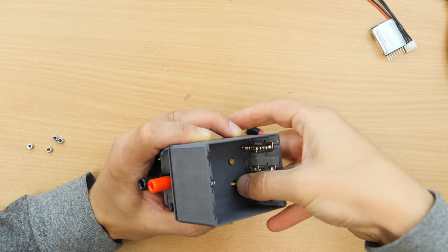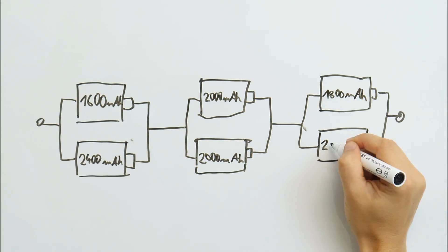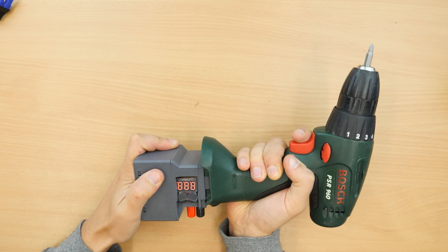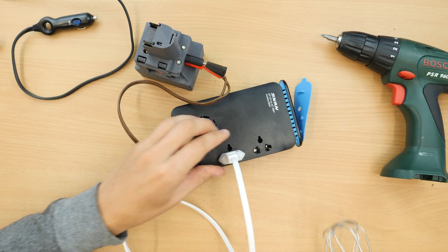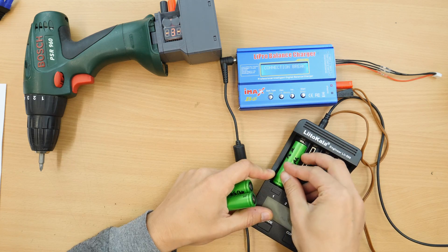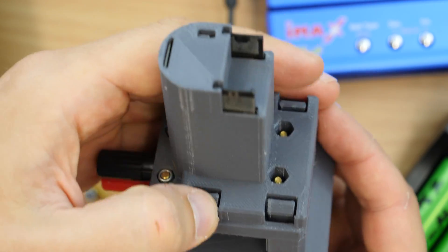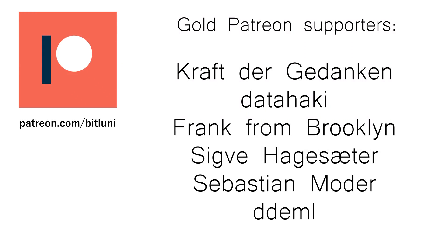I wired everything and assembled the three parts. When putting in the batteries, try to pair them such that the pairs end up with almost equal capacity — this way we can utilize the pack the most. The tester can be unplugged easily since there is no off switch. The drill works great. Now when fully charged, we have around 12V of power that we can tap for any purpose. We can connect a small 12V inverter to convert it to mains voltage and power any other tool. Nice! I paid under 20 bucks for each of the chargers, a few euros for the printing, and some cents for the small parts. Even though it took me two days to construct the case, it was fun and now I can print as many as I need. You will find links to some parts in the description. If you enjoyed watching this video, don't forget to subscribe for weekly projects. And thanks to my Patreons for the support. Bye!